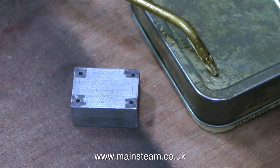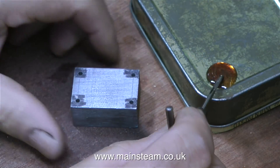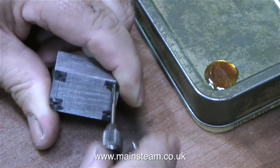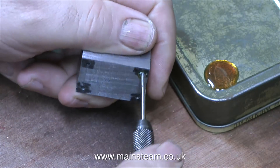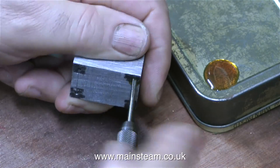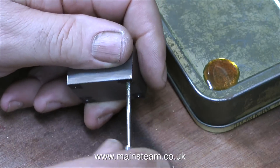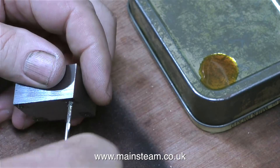Now I'm going to thread these holes using a 6BA tap. The lubricant I'm squirting onto the upturned tobacco tin is my usual lubricating oil that I make up from 1000 grade steam oil at 50%, 3-in-1 machine oil at 25%, and the magic ingredient — rapeseed oil, or canola oil — making up the other 25%. I find this oil mixture to be really effective when lubricating the bearings of steam engines. It's just a bonus that it's also very good for the lubrication of taps and dies when thread cutting. And in no time at all, I have four 6BA threads in the corners of the metal block.